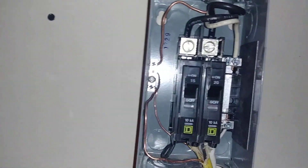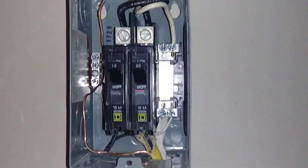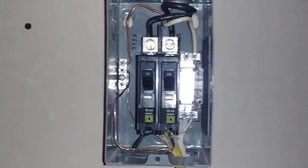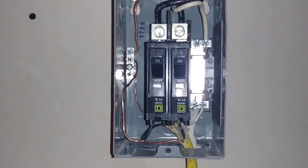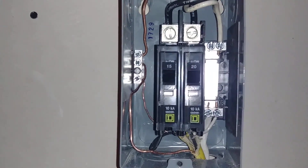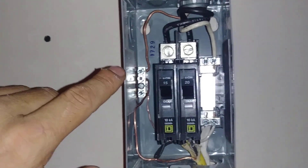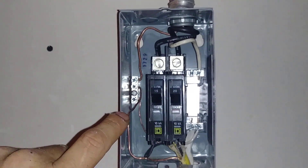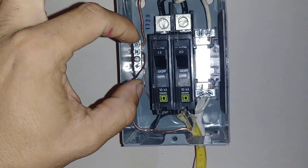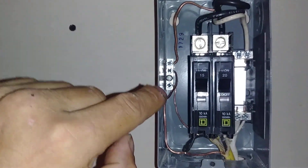The issue I had too was that when I first purchased this sub panel, there was no ground bar. I was looking online and a lot of people were saying you can actually connect to the neutral bar. No, you can't connect it to the neutral bar. Turns out that you can't connect it to the neutral bar over here — that's the neutral bar. So what I had to do was buy a separate kit for this sub panel, and you basically mount it to the back of the sub panel over here on the left side. That way you can run your ground wire from the main panel into this panel here.